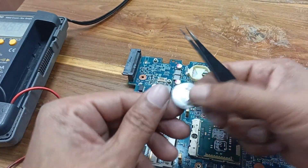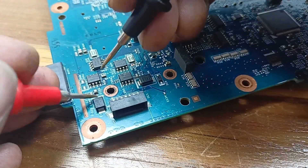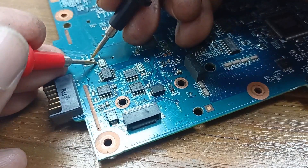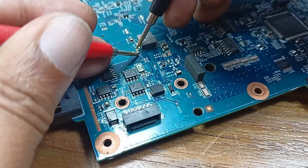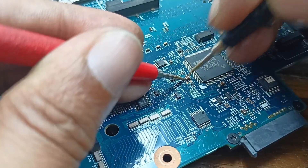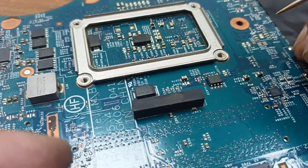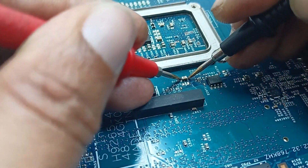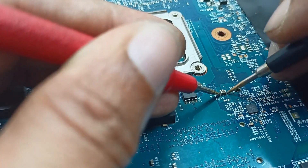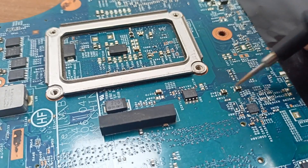This battery is a damaged battery. Let's check some capacitors in this circuit — check if they are hot or not. This one is okay. This one is okay. There is no short circuit here. No short. No short. No short circuit. Now — yes, here is a short circuit showing. This one, and this one also. Maybe one capacitor is shorted. I need to open and check this.